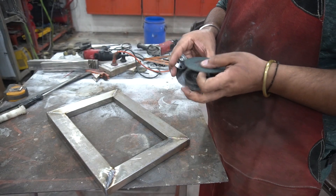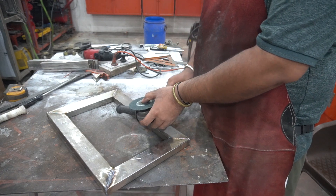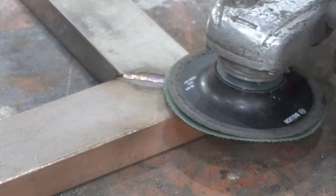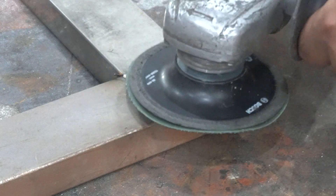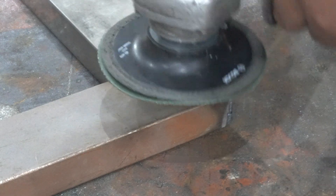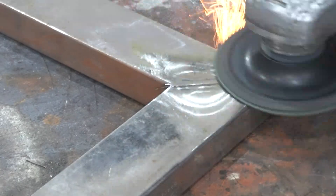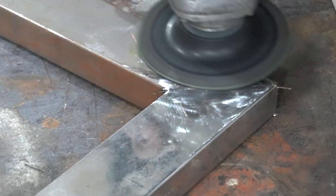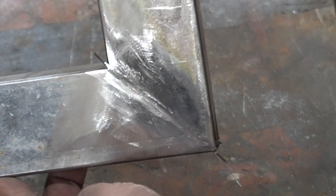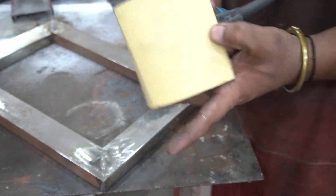Since we have to weld legs onto the corners, we have to grind the frame first. Here we are using a 60 grit fiber disc and the aim is to maintain flatness during the grinding process. You don't have to apply too much pressure onto the wheel — just move your hand in a steady direction and let the wheel do its work. If you push too hard it will deteriorate faster and leave deep gouging marks that are difficult to remove. While using the velcro disc, make sure to use a slow speed — that's the only way to get more out of these discs.